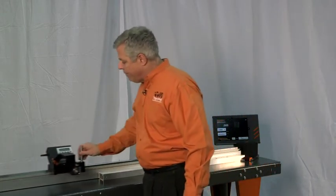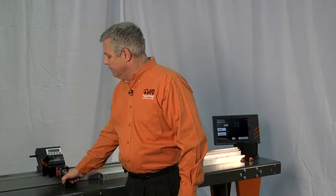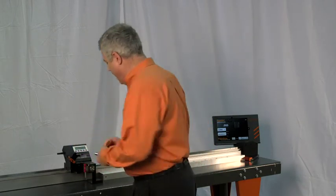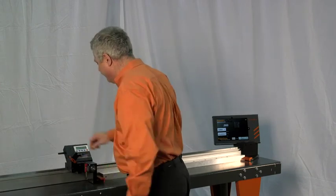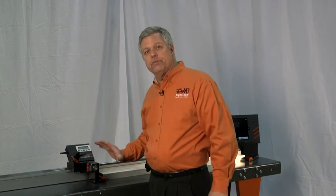Now there's one more problem — how do you measure the overall distance? This is literally a revolutionary feature. You simply turn the device over, lock it into position, and add the snap-on jaw. The zero datum points remain constant throughout. Bring it up and you know it's 46.205 inches long. No separate machine needed, no changes to setups or calibrations — it was fast, simple, and accurate.